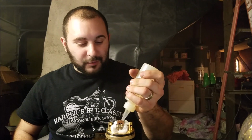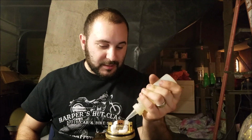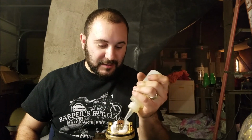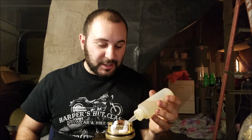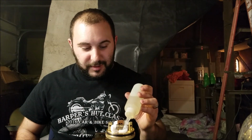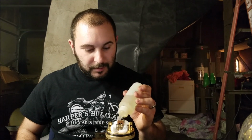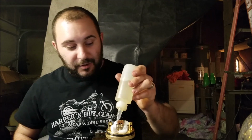So I can literally fine tune the coils for the exact resistance that I want. I can check each coil individually. If they're not connected together, I can actually connect it to the leads. Very, very cool. It would still cost at least $1,000 for a used version of just the resistance tester, and I don't think even the portable testers read past the 1,000th of an ohm. So I'll be able to tell you down to the 10,000th of an ohm what these coils are.